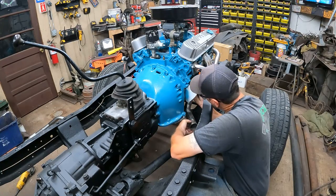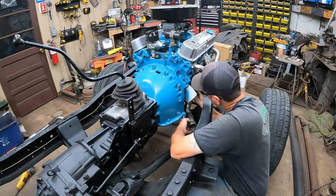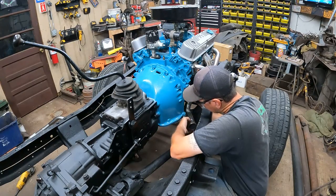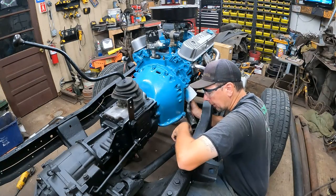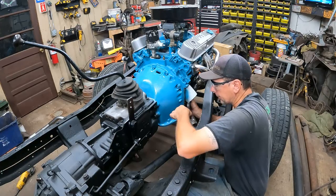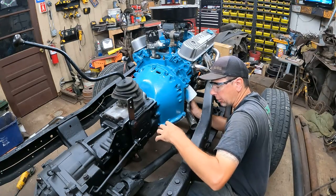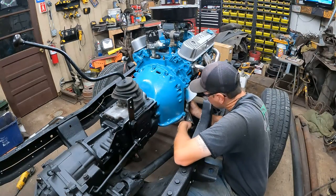And I've just been trimming it and fitting. I think it's going to work like this. I think I can tack it in place, get this leg on. It fits good to the piece on the header. Tack this. And then down here, I need to bend over. I'd like to take some of them U-bends, bend over and come up and double kick it, put the converter right here, and then run out around with some more bends.